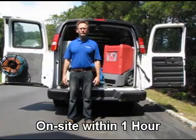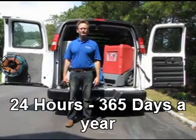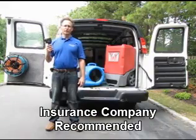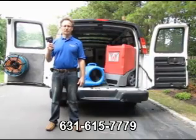There are a number of tools that we use to determine the location and the amount of water. The first tool I am going to show you is a thermal imaging camera. This camera is able to locate water sources by measuring the temperature differential that water creates.